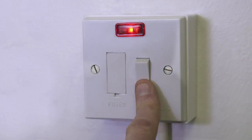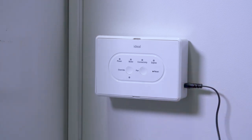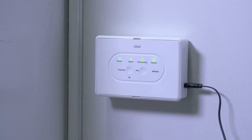Turn on the electric power to the boiler. Insert the 24V DC power supply jack into the bracket until a positive click is felt. Plug in the power supply and switch on power. The smart interface will go through a startup sequence of flashing LEDs. Once this is completed, only the green power LED will be illuminated.